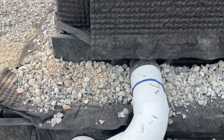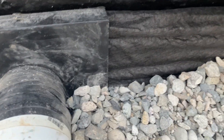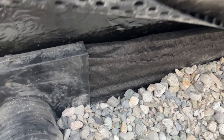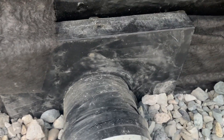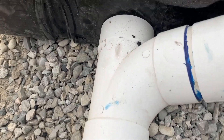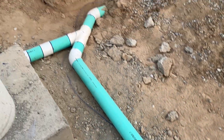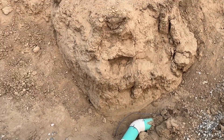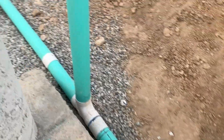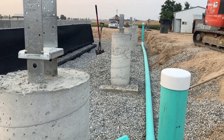Here's an example of the SWD drain and how it comes over with a T-fitting — you can see that six-inch material right here. It's a T-fitting that comes out into a four-inch pipe, so we go to solid pipe at this point. These fittings are glued up — one picks up the footing at the bottom, and then they take off out to a drain field that will absorb any water that comes out. We also have our gutter system tied in, dumping into these pipes.